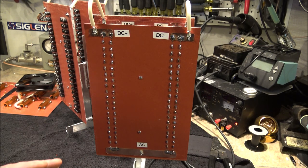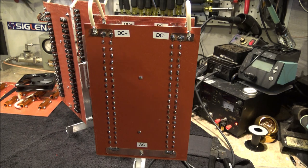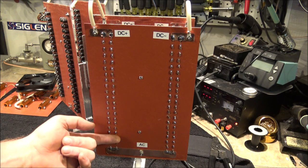I did this beautiful ornate board for Vader. I think I called it backyard chemistry, and it was where me and my kid sat down and I taught her how to etch boards. We etched out this beautifully ornate board that had all these solder pads on it, and I soldered a ton of diodes on the thing. I think I had 3 diodes per string, and then I had like 14 strings, and I went way super overkill. Well, we ended up having a breakdown issue where all the diodes were tied together.